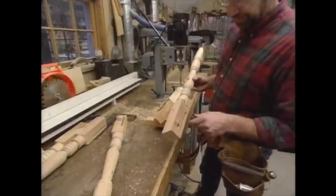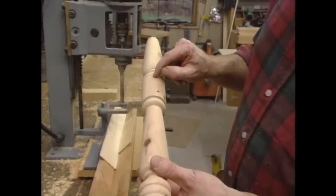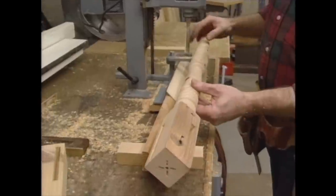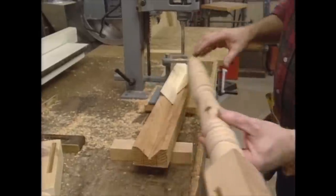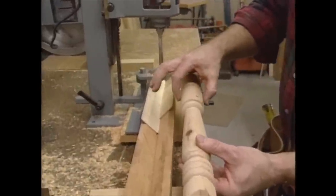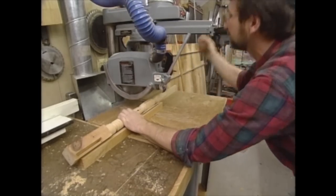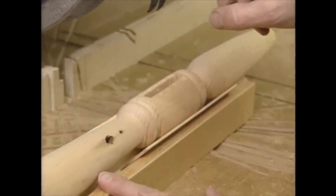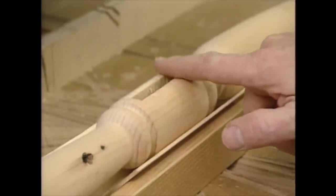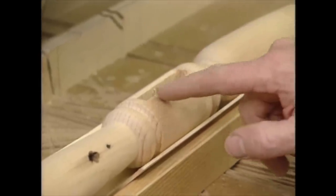Let me show you how I'm going to locate that mortise. At the top of the leg we have the mortise for each rail; directly below the corner is where I want to locate the mortise for the stretcher. That means I have to hold the leg in a diagonal position, which would be very hard to do freehand. So I brought out an old jig that I had in the shop with a V-groove cut at a 45-degree angle, and I'm using a couple of shims to make up the difference between the diameter and the square portion of the leg so that it's nice and flat. With the leg still in the jig, I've switched to my radial arm saw with a stacked dado head cutter and created a flat spot right at the mortise area because the stretcher, when it fits in, will have square shoulders — assuring a nice tight joint.